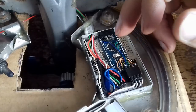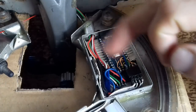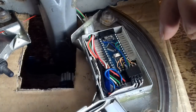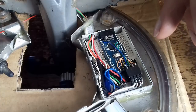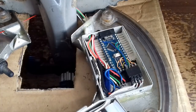We have these four wires which go to the amplifier. The green is battery voltage, so about 8 volts — that's the power supply for the amplifier. White is the strain gauge voltage, which comes back to the Arduino. Red is 5 volts from the Arduino — that's the voltage applied across the strain gauge bridge. And black is obviously ground.